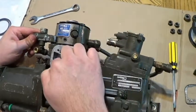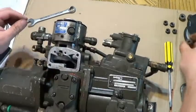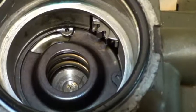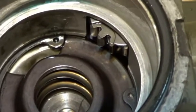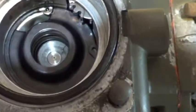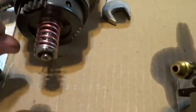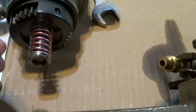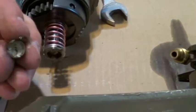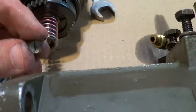Now that timing mark down there is lined up, take and wiggle this and it'll come up and out. These two clips will come off — retainers. And there's the hydraulic head right there. To know that you got it in the right position while you've got the hydraulic head out — if you look at this gear, you can see there's a tooth that's notched; that should be pointing into the housing. There's also a button that rides down in the very bottom of there on the bottom of the hydraulic head. Sometimes that'll fall off. This button right here — it's got kind of a cup shape on one end. The cup shape should be pointing towards this shaft. Put a little dab of grease on it before you put it back in, because if it falls off, it falls down inside the pump.